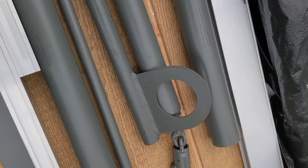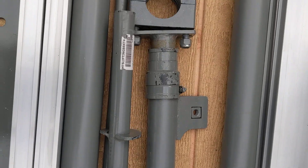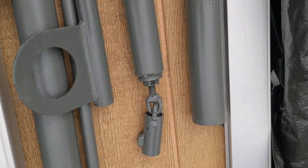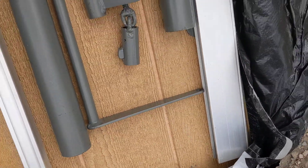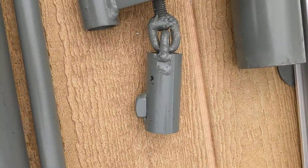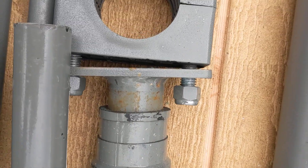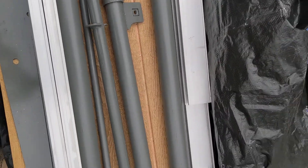This cool thing is to raise it up the pole. This cool thing was a mistake gift. The one I ordered, you adjusted the angle in fixed increments standing atop of the pole. This thing has a handle that goes in this hole, and as you twist it, that section between the nuts goes in and out to get an exact angle on the panel.